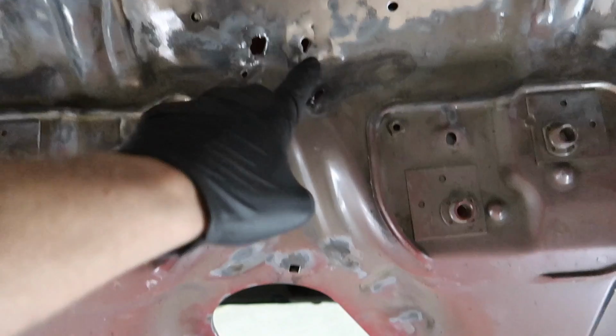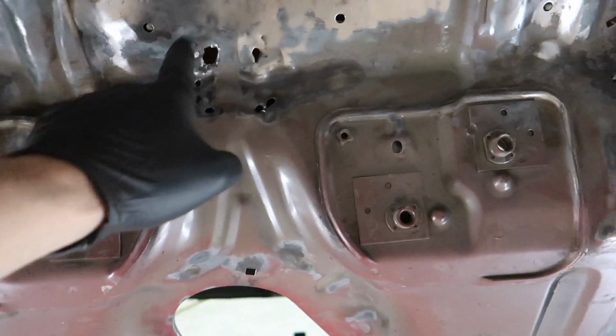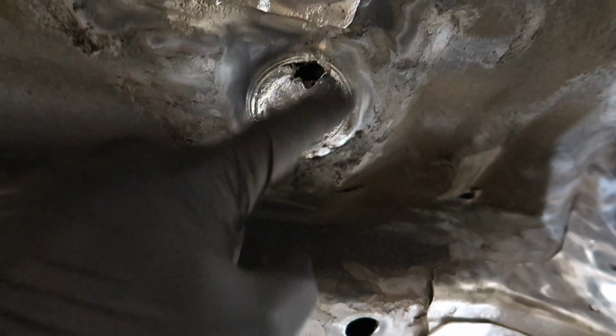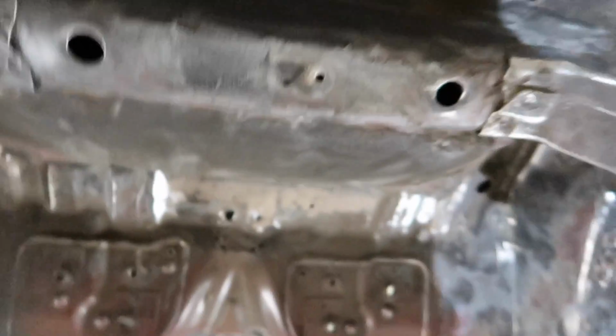This I've got to patch up. These lovely welds that are fucked. So I'm going to put a little plate over there and cut it out. And then I've got this to cut a little ring out there. And then just put a plate round it and just weld that up, and that's it. I've got one there. And I've got one here. Same metal, but it's all rotted on the outside, so I can't see it lasting.